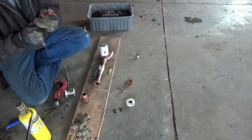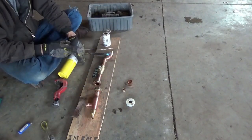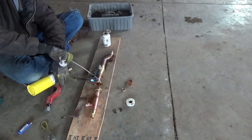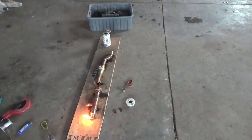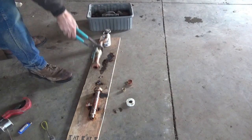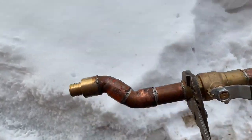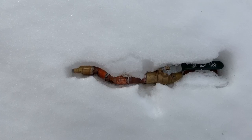For whatever reason I've been carrying around a one-inch pressure regulator for about seven years now. I bought it for some particular job and never used it. They're not cheap and it's a perfect application for what I need now. This pressure regulator guarantees that the pressure in the house will not be any higher than about 75 pounds.